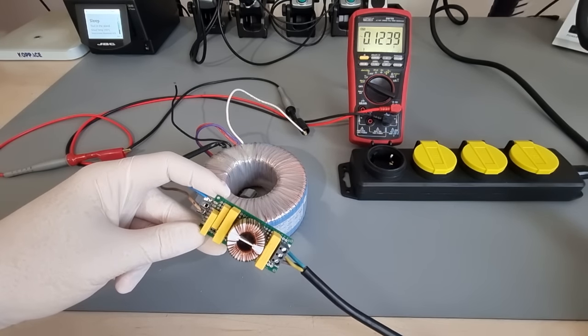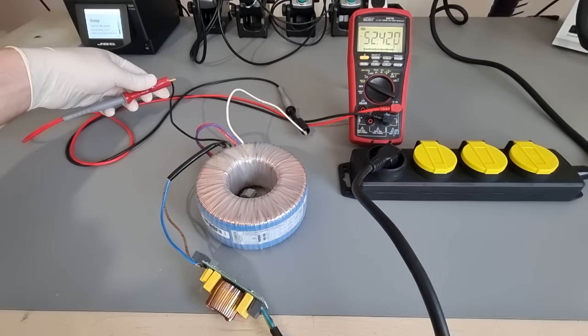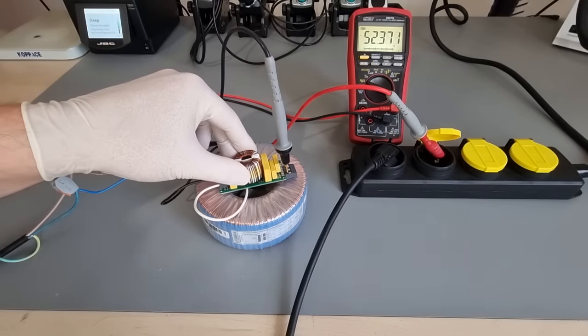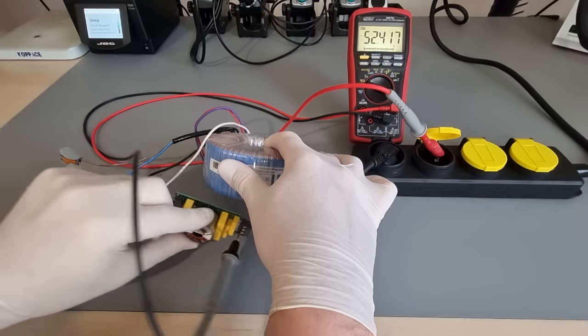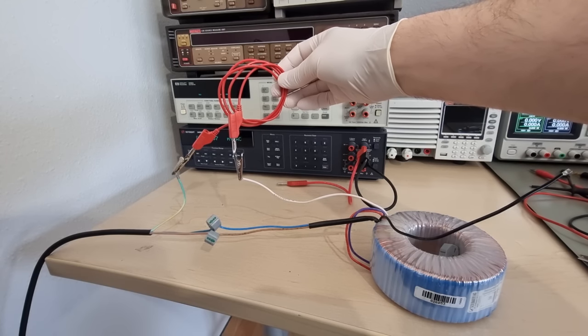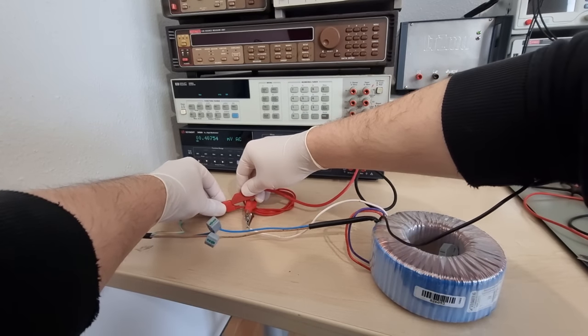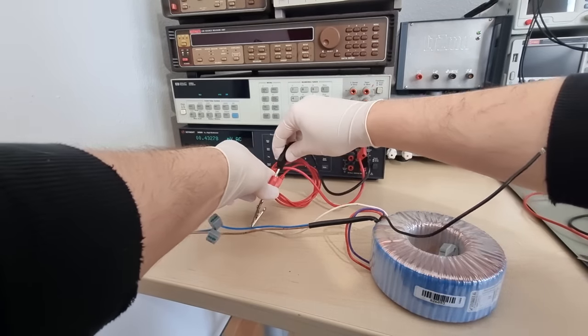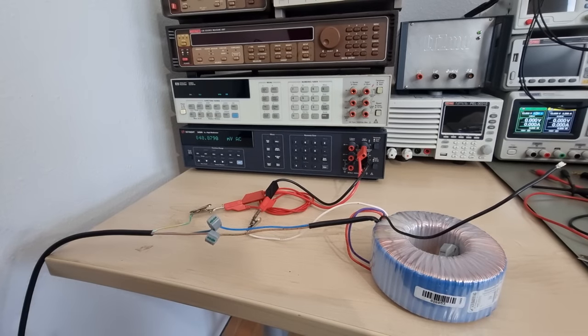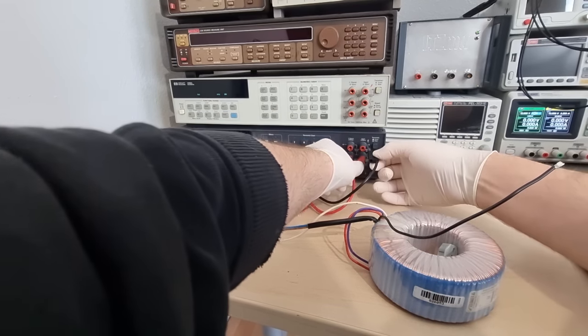A common common mode filter in a practical size doesn't help at all — neither before nor after the transformer, nor above or below it. These are simply made for higher frequency content. Normally in consumer hardware that doesn't matter much because the transformer secondary side tends to be grounded. But in electronic test and measurement equipment, it is desirable to be able to choose if, how, and which signal to ground. That can lead to strange intransparent conditions where suddenly the mains wiring in your walls, chassis capacitances, or a voltage drop over your test leads can impact your measurements.